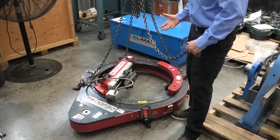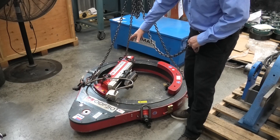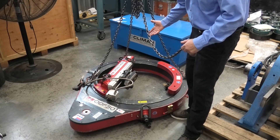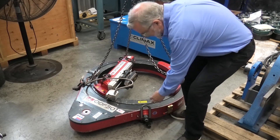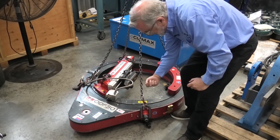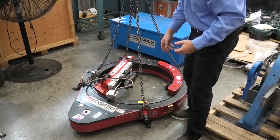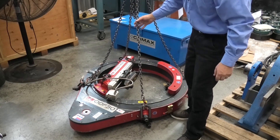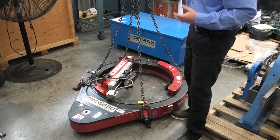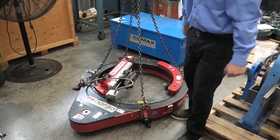When we're ready to lift the machine, I want to make sure I orient the arm so it doesn't interfere with the placement of my lifting eyes. I want to make sure I use the four heavy-duty lifting eyes and I like to put the chain from the inside so there's no chance of it popping off the hook. Now I'm ready to lift it into position and preset it for the flange.